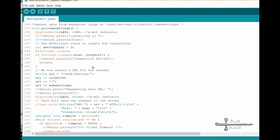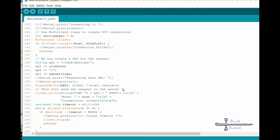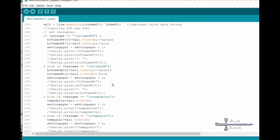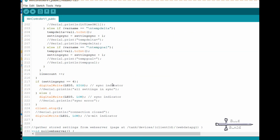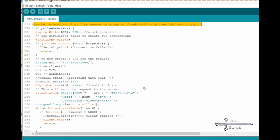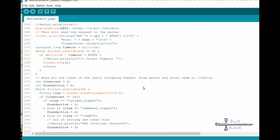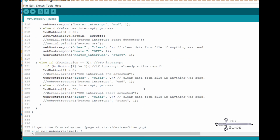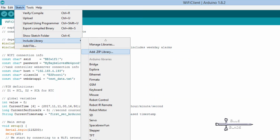For the DS1307 real-time clock, I use the DS1307 NodeMCU library and tiny RTC module, just like with my main Aquarium controller. However, this library isn't included in the desktop Arduino build and must be downloaded and installed. I downloaded it from the Create website by searching in Library Manager, then selecting Download. You can do it that way also, or you may use the copy I include in my GitHub link in the description.